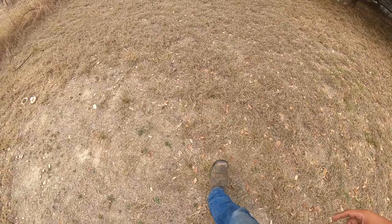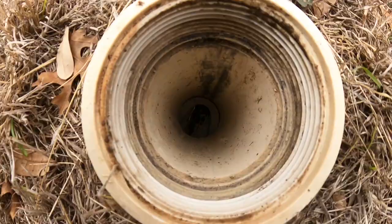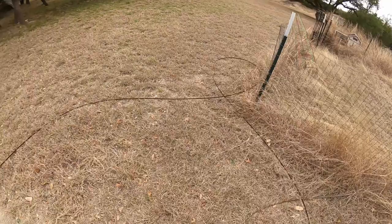So there's going to be an inlet right here coming from the house, and then we've got an outlet where it begins to go into the drain field. They've got a snake out here — I'm not sure if they're backing up — but we're going to go ahead and dig up the tank and take a look, and pump it while we're here.